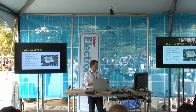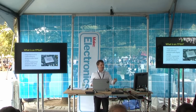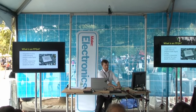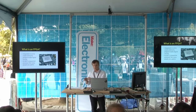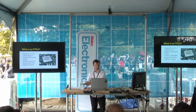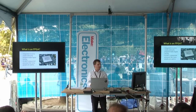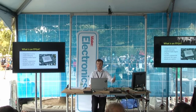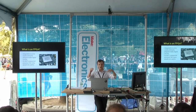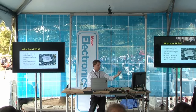The presentation is about what you can do when you integrate FPGAs with these embedded Linux platforms. A Linux computer is only so good at so many things — it's good at high-level computation. But an FPGA is what people use to interface with hardware. It talks to the low-level components and has the protocol interfacing on it. It's a reprogrammable circuit. It's not sequential logic — you can arbitrarily route I/O in and out of any pin on an FPGA from software.